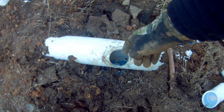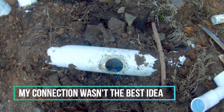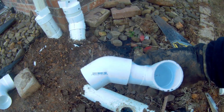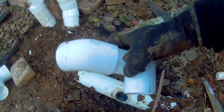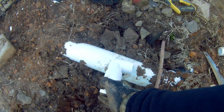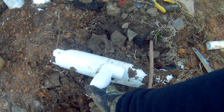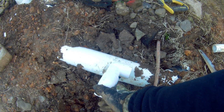With that 45 in there, the water is just hitting the back wall and forcing it out awkwardly. What you have to do is get the water flowing in the direction of your pipe. So I'm going to put my 45 on there and then a slip 90 — slide it in there, glue it, and put this in there. That'll sit in there so my water goes in the direction my pipe is facing. That way I don't get all that kickback from the pump. We should be good.